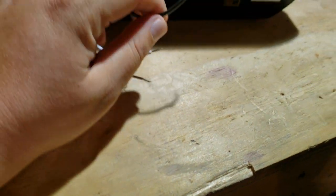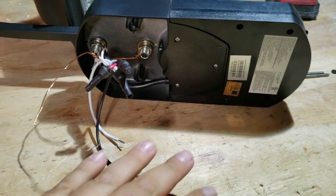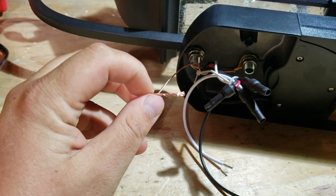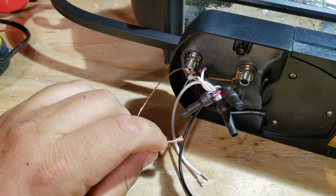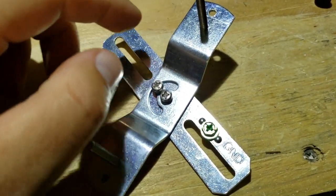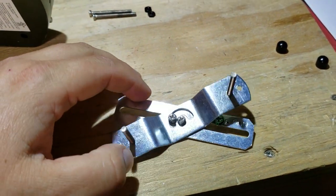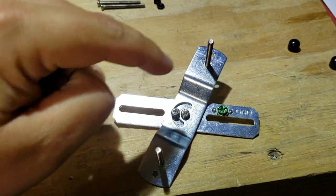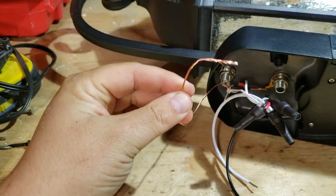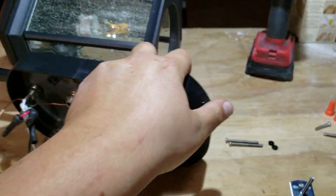This is your hot wire — the one that carries the power — and the white one is your neutral wire. So you only have three wires to hook up. If your outdoor box is metal and already grounded, you take the ground wire from the light and screw it into the terminal marked GND. When you screw the bracket into the grounded metal box, the bracket itself becomes grounded, and then connecting the bare wire to the screw completes the ground circuit.